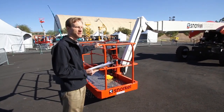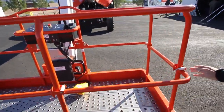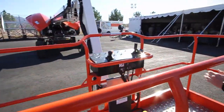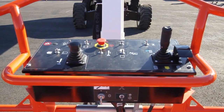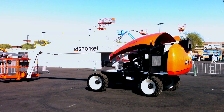This is an eight-foot steel frame platform. It's steel for strength and durability, and we used aluminum for the flooring to reduce weight as much as possible. Looking at the controls, they are proportional drive, proportional boom lift and boom down, as well as boom turret, and that is going to be common through all three of our machines.